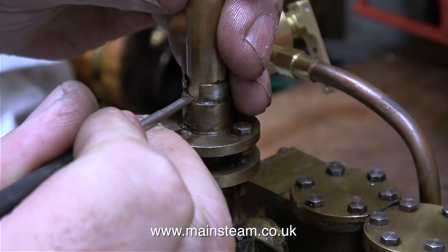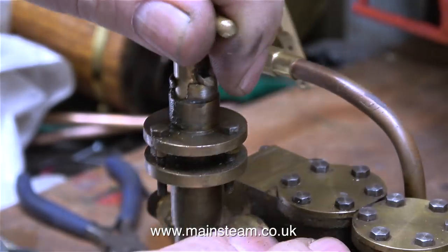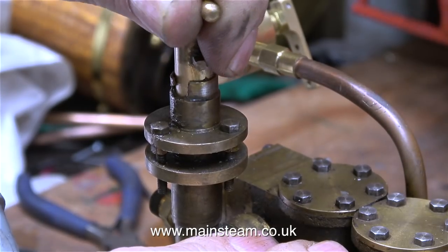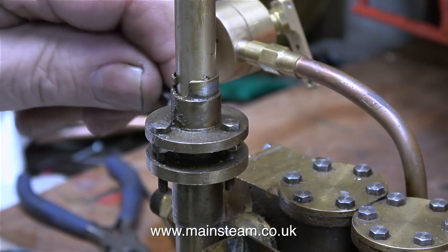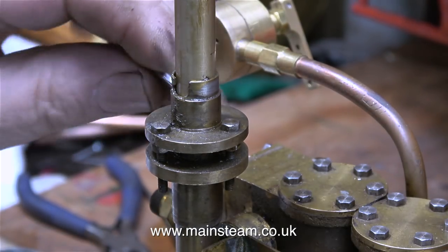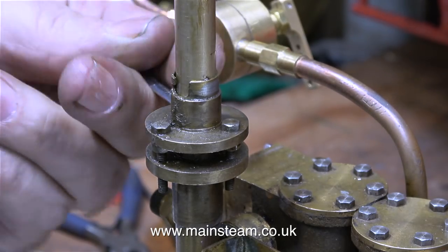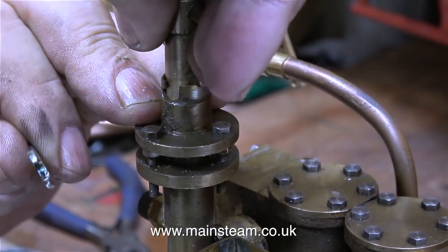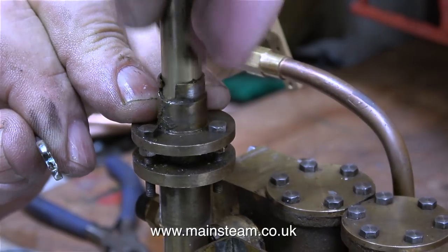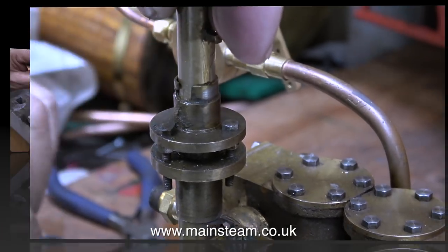Now I'm very carefully refitting the ram into the tube. Because of the cutout in the tube for this bayonet fitting I carefully used a blunt screwdriver to persuade the O-ring to go into the tube and not stick out over the edge of the cutout. Then I just slackened off the gland slightly. The gland is still going to be functional but it's not needed because I don't think any water is going to pass the O-ring. There does need to be some resistance of the ram in the tube and I can feel that there is, so everything should be okay now as far as the engine is concerned.